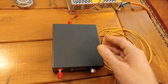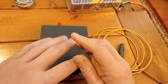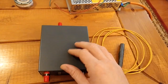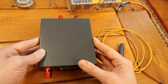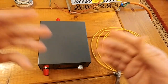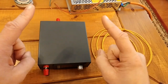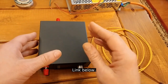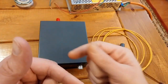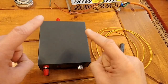As for the unit itself, it's only 75 bucks, so very affordable on AliExpress. I did pay full price for mine and I'll put a regular link below — not affiliate, none of that nonsense. These models have been reviewed pretty thoroughly by Dave Jones on the EEVblog, which I highly recommend for learning about PCB engineering and design. He did a review on this model specifically and it didn't go so hot — an early revision had an issue with a ceramic capacitor placed right by the screw terminal that would crack, short, and cause the board to smoke immediately. I'm happy to announce that issue has been fixed on this revision and it seems rock solid in my testing.